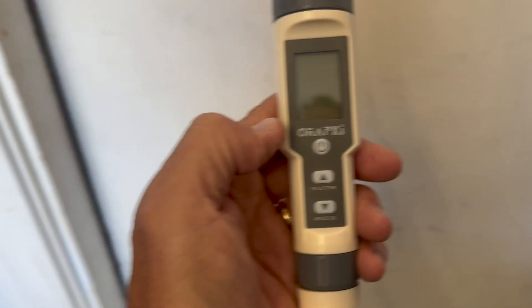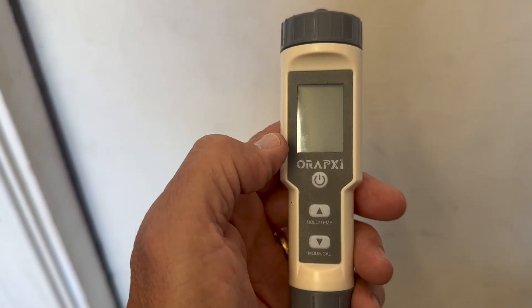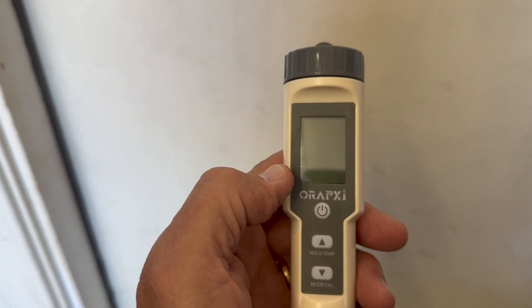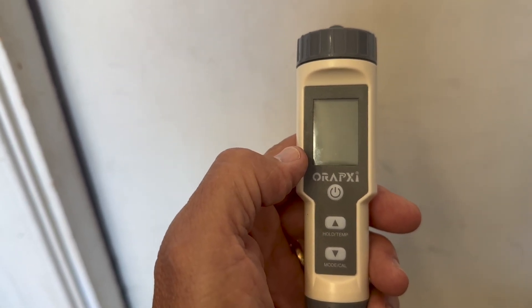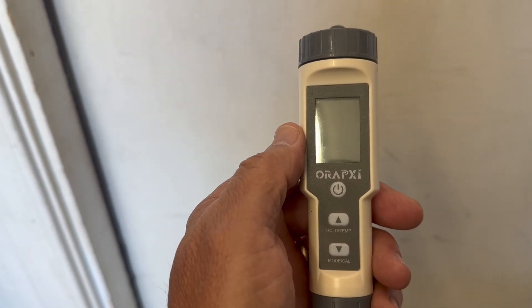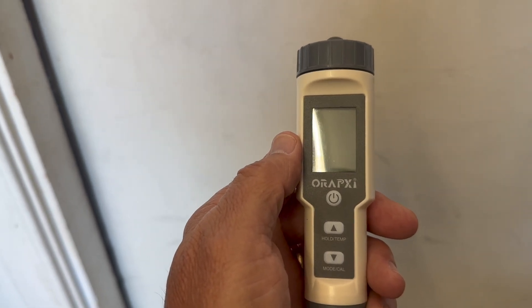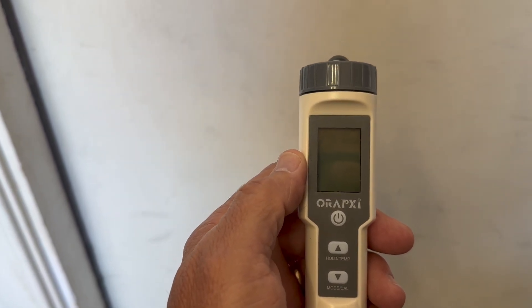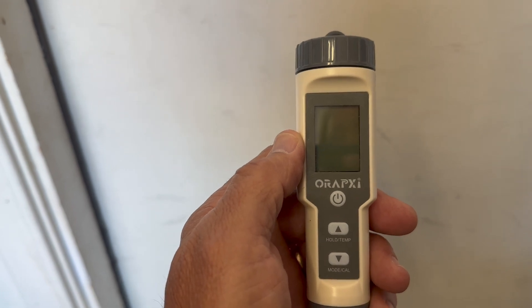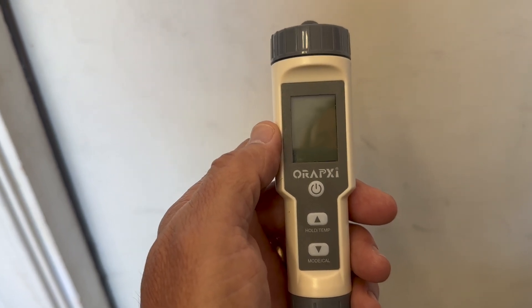This unit also tests total dissolved solids, but I'm not a fan. For a typical saltwater pool, your total dissolved solids — which include the salt — are between 3200 and 3400 parts per million. If you look at total dissolved solids readings on a test strip, it'll say you need to replace your water at that level, but that's not the case with a salt pool. I'll put a link to my TDS video in the description. Anyway, let's go to a pool and see how easy this unit is to use.